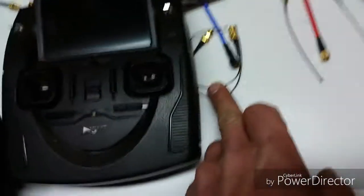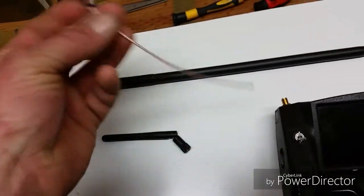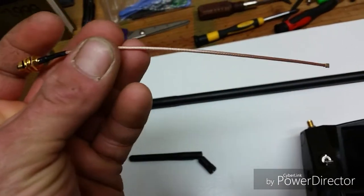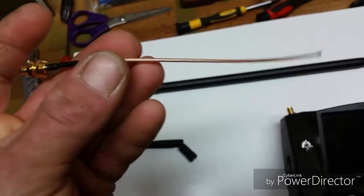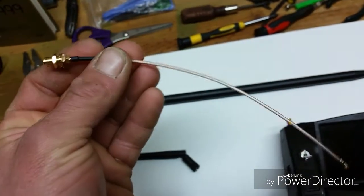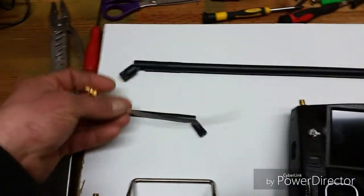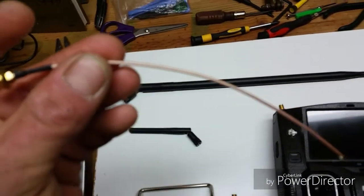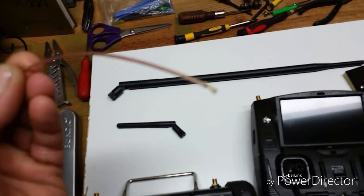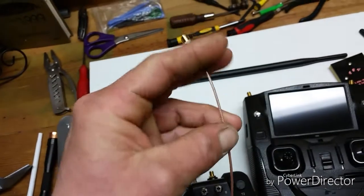These wires are very tiny coaxial cables. A good idea is they sell these on eBay. This one's a little bit long so I'm not going to use it. These are called RG-178 wires — they're very low loss. This happens to be an RP SMA, but it's a bit long. When you use these type of wires, they're high-grade copper. As long as you get SMA to IPEX, they're the same thing, but these are way better wires. You can get them in any length.